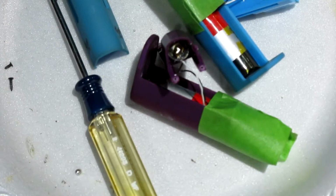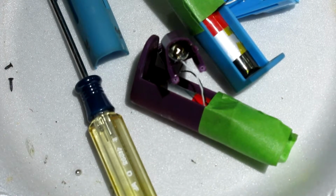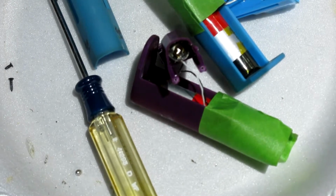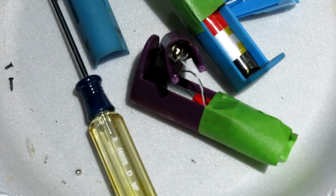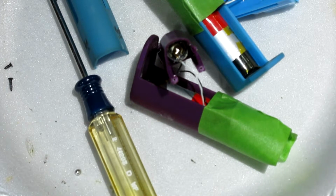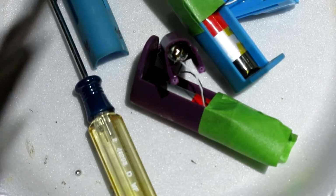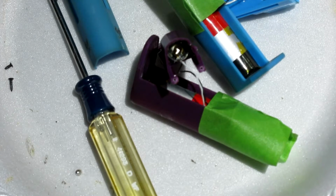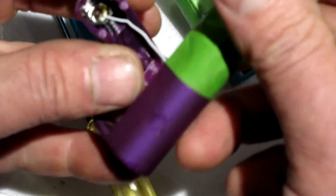So what I was doing with these was, once I got them soldered, I was starting up my hot glue gun, and I was injecting hot glue all in around it, and that was what I thought was a good idea, to hold that wire in place, but the next time it quit working, I had to dig all that hot glue out of there to fix it again. There were a couple people I know who have these, and they always want me to fix them. All the ones that came back, I could tell which ones I'd been in because I had hot glued them. Another one, I took that liquid black tape and taped around it. It wasn't as bad as the ones that I hot glued, because that turned out to be a real train wreck getting that out of there.